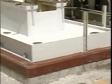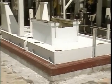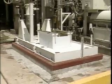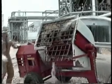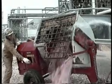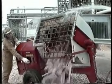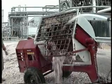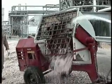After sufficient curing time, the forms may be removed and the concrete portion of the foundation may be painted with Philly-clad 1000 series epoxy coating if so desired. Clean all tools, wheelbarrow, Jiffy mixer blades, and mortar mixer with soap and water. Check with the local safety or environmental engineer at your plant for proper disposal and handling of cleaning water.